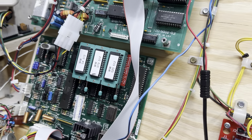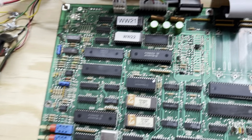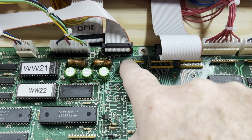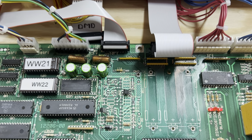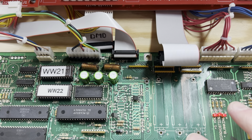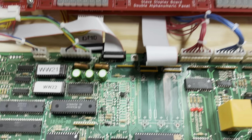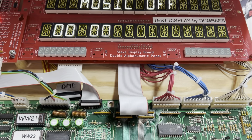All of those sounds are coming from the soundboard, and that proves that the interface through the narrower of the two ribbon cables is working correctly. That is driven through either U41 or U42, but all the traces up to there are working properly now.